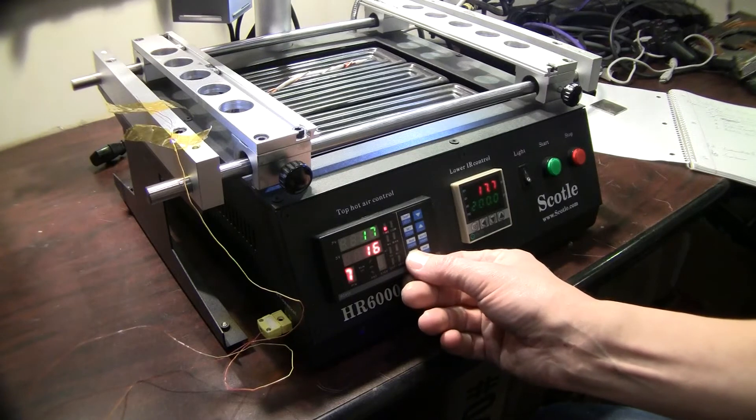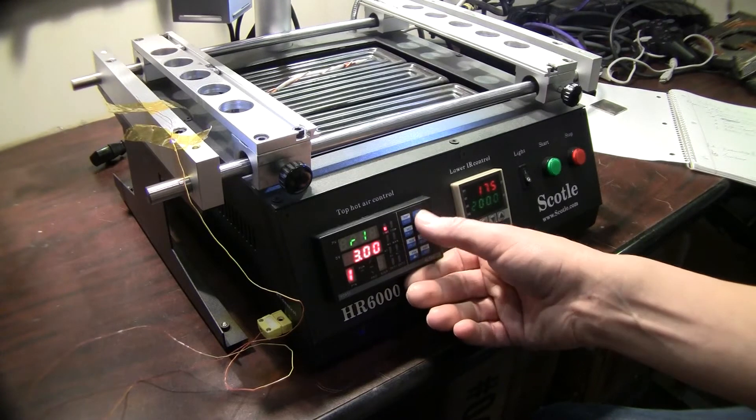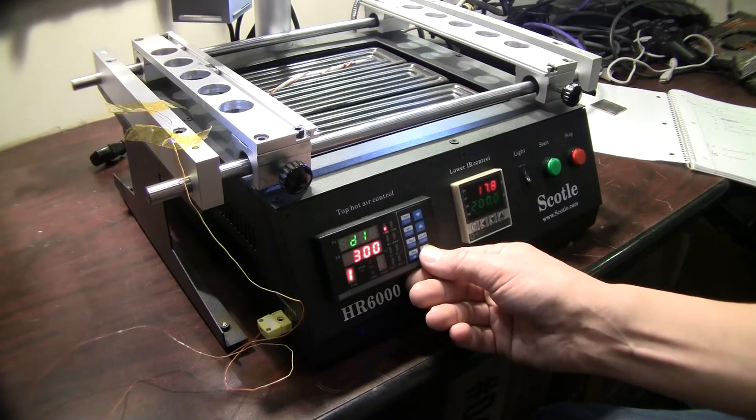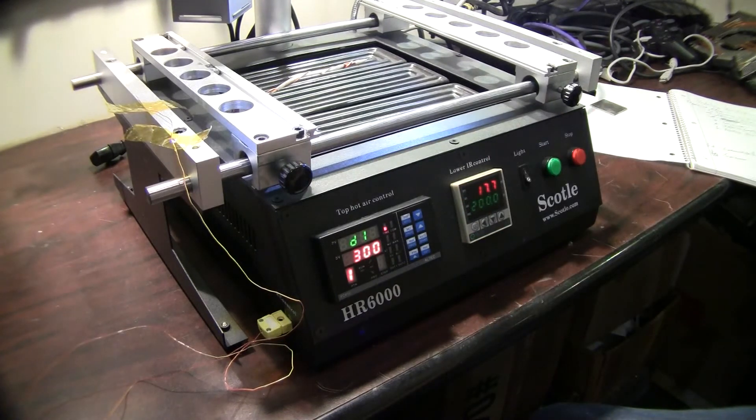Following your profile sheet, you're going to go ahead and key those in. Typically you're going to select the partition you want and then press the set program button or enter button. Then you're going to enter your parameter and hit parameter set, then go to the next one. Enter it, hit program set, and repeat that process until you get to your last value. If there's a value in there and you don't have a value for that phase, you're just going to set it to zero or blank it out so it ends the profile. Setting those values to zero will terminate the profile at that phase.